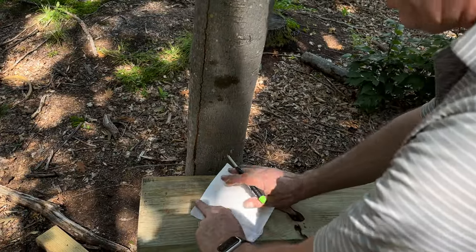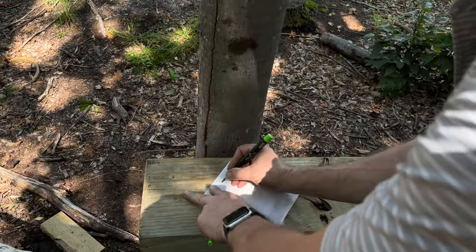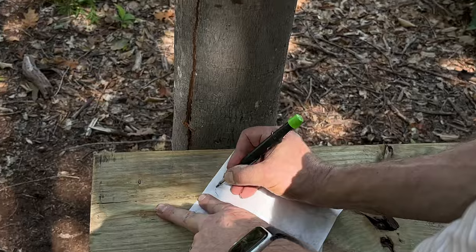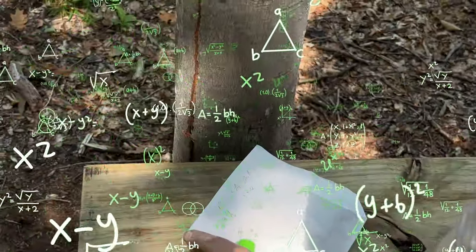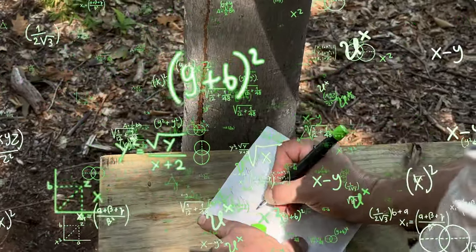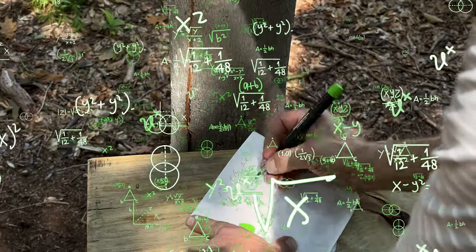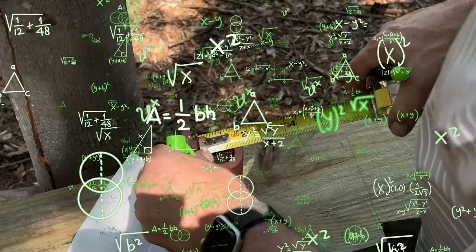All right, so we have to figure out where to put the tab on the tree. At the top, we've got 5/4 inch decking, which is actually an inch. Below that, we have a 2x10, which is actually 9 1/4. Below that, we have this beam, a 6x8, so that's 7 1/4. The diameter of this opening is 3/4 of an inch, and half of that is 3/8. So we almost forgot to use all that fraction adding we did to subtract off from the site leveling.